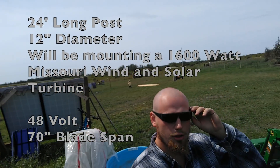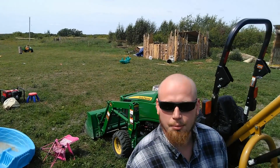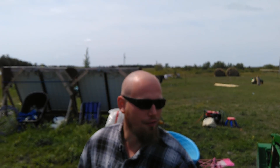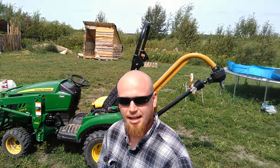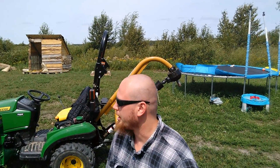The project for today is to try and get a pole in the ground for our wind turbines. I'm hoping that if I put a wooden pole in, I won't need guidewires. So I'll put a wooden pole about 16 to 20 feet out of the ground, then put a 10-foot inch-and-a-half steel pole on top of that. We're going to dig down with the front end loader first to get deeper with the auger bit, and that hydro pole is going to get delivered a little later today.